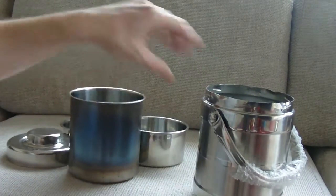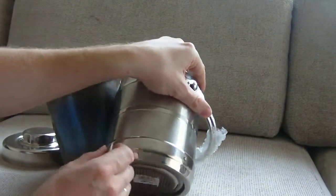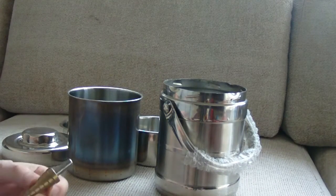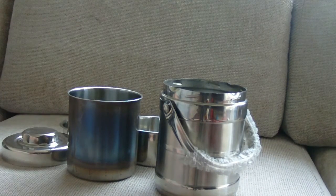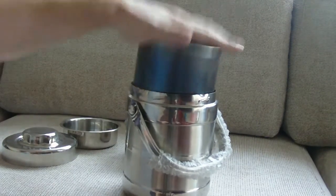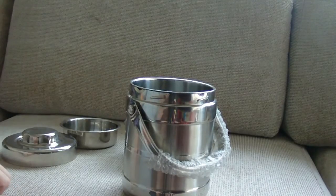These will be five to six mil holes around the sides. Then on the bottom section I'm probably going to do four 12-mil holes. I'm not going to do too many holes at the moment and not make them too big, because I don't want to mess it up on the first go — otherwise I'll have to use my Dremel again, which was not too easy. Let's see how we go.